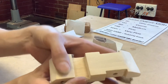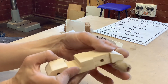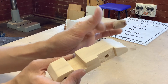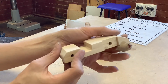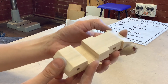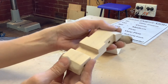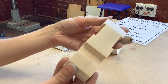It's important that you go up through the grades. If you're applying an oil finish especially, you want to go a lot finer — it'll feel almost like it's been polished, and then you apply your oil over the top and it goes in really nicely. Wax finishes can sometimes require the same. But for anything that's going to raise the fibers of the wood — like a shellac, lacquer, or paint — this level of sanding is fine, because in the process of applying multiple coats you'll remove any extra bits and end up with a nice smooth finish.